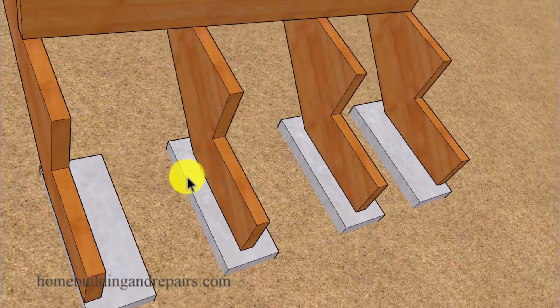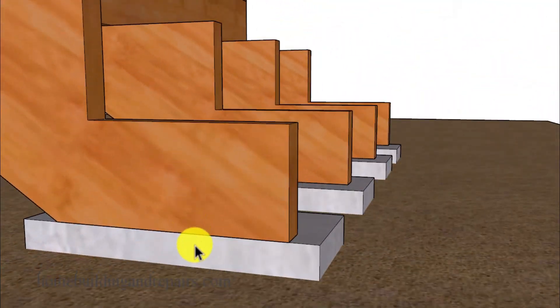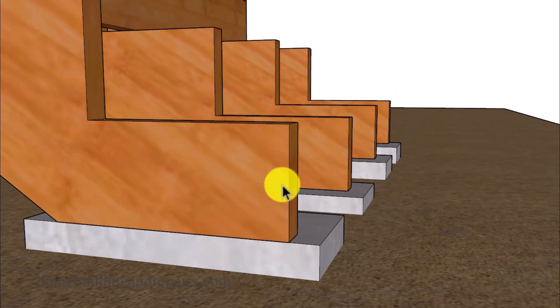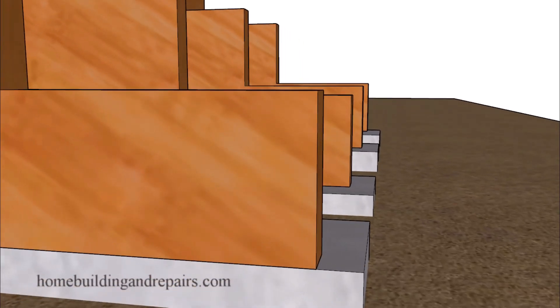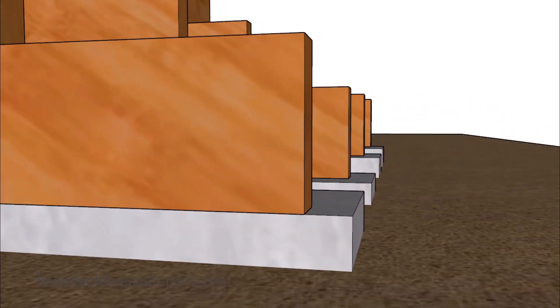The project I saw looked like they poured the footings after they set the stair stringers, but I'm not sure. Here we have a set of stairs where everything is nice and straight. Then maybe in a few years, you end up with some of the stringers and footings either sinking into the ground or raising above it, creating a situation where you no longer have, in my opinion, a safe set of stairs.